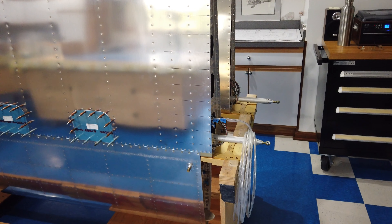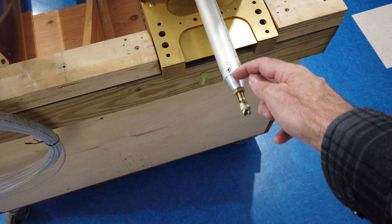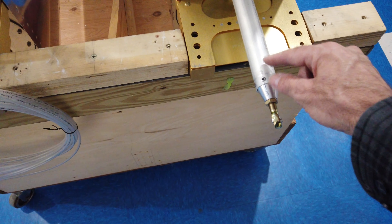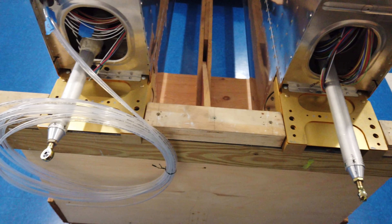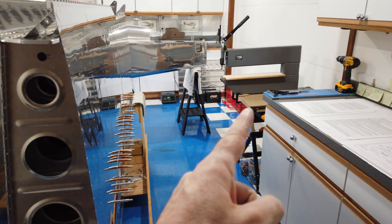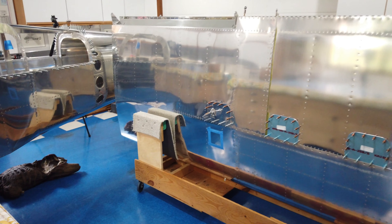I want to get all the loose ends tied up on the wings — take care of the holes like I just talked about, verify the length of these rod ends, and make sure I've got good depth engagement inside each tube on each end. If I'm happy with that, I'll go ahead and make spacers for these, whichever ones need them — probably all of them. I'll store the fairings, possibly just attach them to the wing, or coil them back up and put them back downstairs. Once the wings are done, I'll stick them back over in this area and move on to the fuselage.